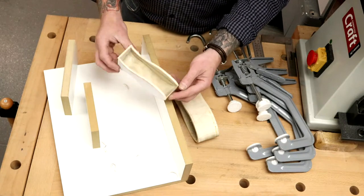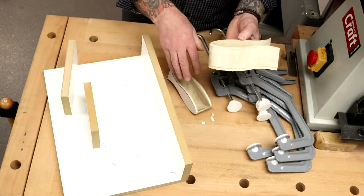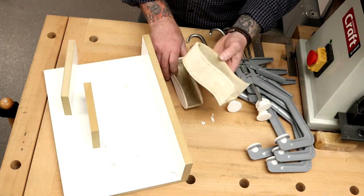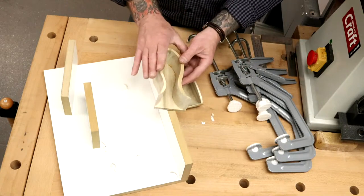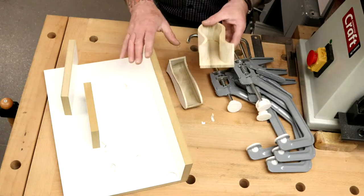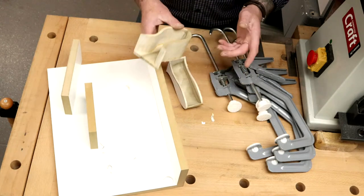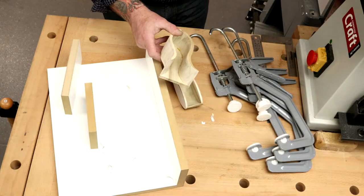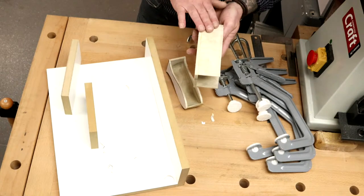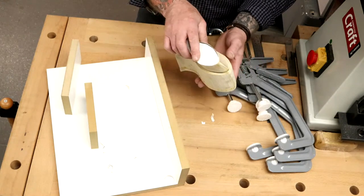All right, lovely little drawer. This is one drawer on this project. I mean, you can do a number of drawers. You can see I've got a couple of bits over there with two or three drawers. I've seen them with 10 or 12 drawers. This is a really good one to get you started. I find, do this one, get your technique down, get your clamping organized, and then go for it. There are some really elaborate shapes. The key really is bandsaw setup, of course, and that blade, that 3/16, 4.8 millimeter wide blade, 10 TPI, giving a really good finish and keeping your sanding up afterwards to a minimum.